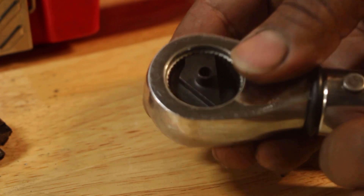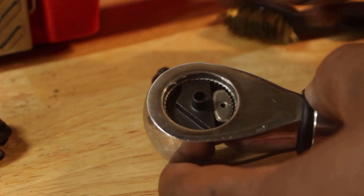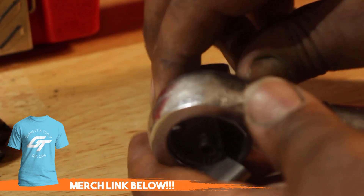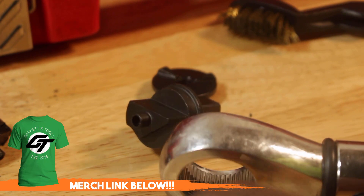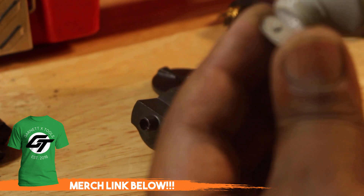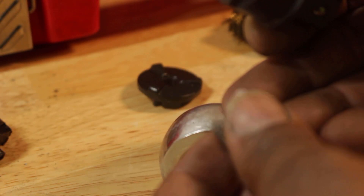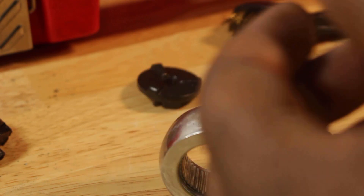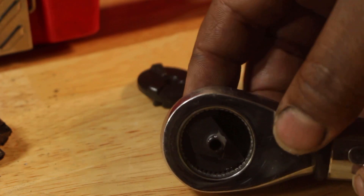Let's see here — it fits in there properly. So I'm going to lubricate the whole entire ratchet. I'm going to wipe it, not overdo it because when you overdo it, you wind up with a situation just like what you had with the dirt where the teeth weren't grabbing fully onto the pawl. And that's plenty right there. So I'm going to take some of that and wipe it across this just so it can ride really easily inside the body of the housing.